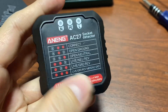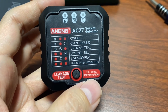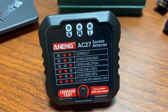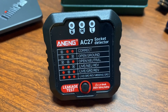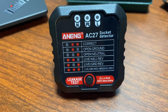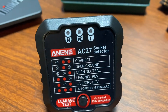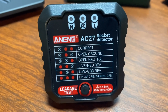It's functional as long as you don't push the leakage test button, because switching ground and neutral is the one fault you will never see on the indicator list — there's no real way to distinguish between neutral and ground. That also means you can trick the tester: a dishonest individual might take a home wired with two-pronged circuits and attach a bootleg ground — just a jumper over to the neutral — and this simple test reads a path to ground because the neutral wire is grounded, and it can't tell there isn't a proper ground.